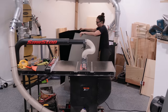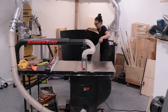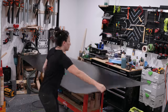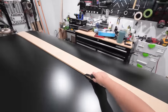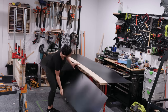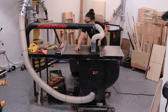I thought I could trim this thin lightweight piece of laminate at the table saw, but it was so large and unwieldy that I couldn't even lift it up to the saw. So I nixed that idea and remembered I had an acrylic cutting tool. I clamped a straight edge to the laminate sheet and passed the cutter along it until it scored the material — then it just snaps, but not perfectly, as I didn't score it deep enough at some point. Once the piece was smaller it was easy to trim at the table saw.